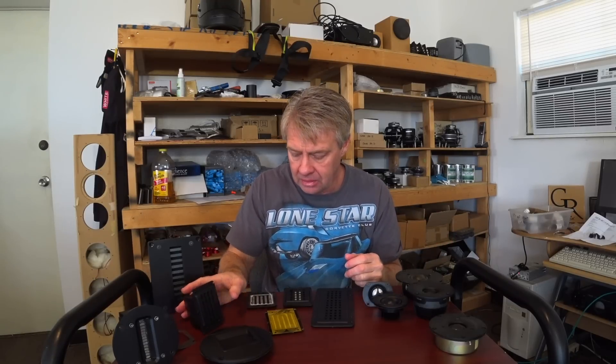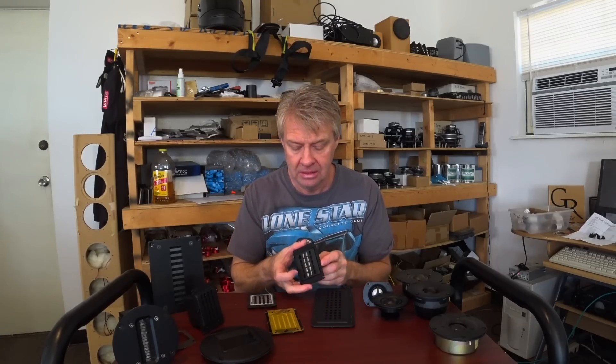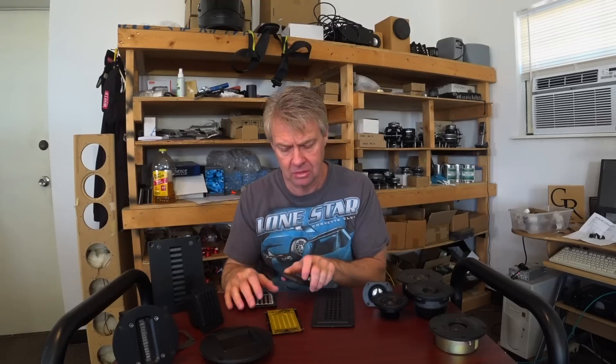The other big advantage to planar magnetics is putting them in an open baffle. When you remove the back cup completely and put them in an open baffle application — wow. They get really transparent, really open-sounding, with no load on the diaphragm at all. They sound really clear, play down really low — they're a whole different tweeter depending on how you treat them.